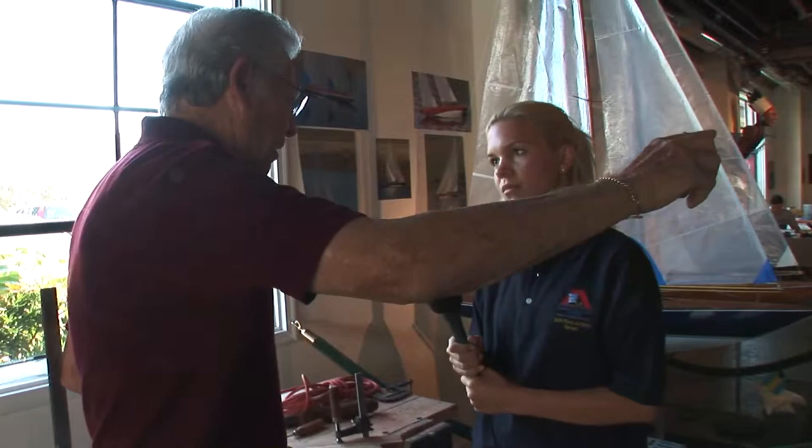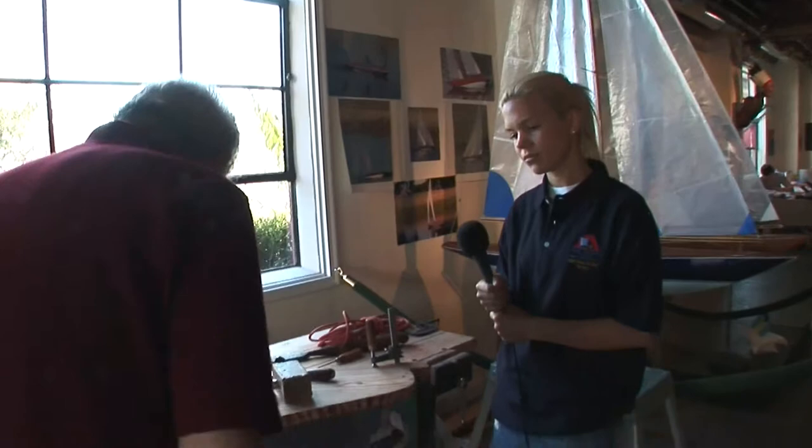Because it comes in at an angle, we have to bevel this so they lay flat against the transom to make a good seal. So it's a lot of handwork, but it's what you have to do to get it done. About how many of these do you have to make? Well, just the one transom on the back. The ribs are bent and laminated, bent to the frames. This is just the transom — it's the only solid piece.